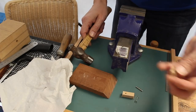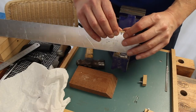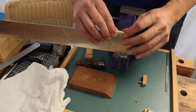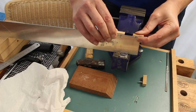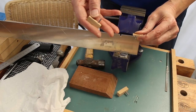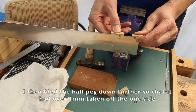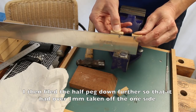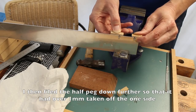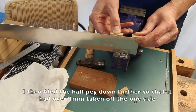What I now have are three little tools which will hold the pegs nice and square and enable me to get much more accurate measurements. And I have one that is 0.3 of a millimetre narrower, so that I can get it in just as I'm coming up to the proper width, so that I can determine which side of the slot I need to widen.